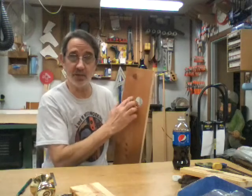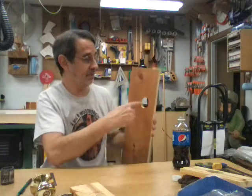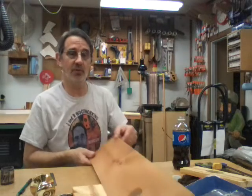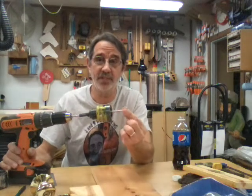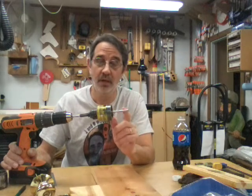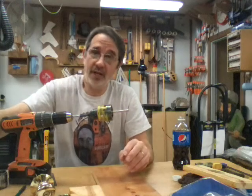The best way to cut this hole out is with a hole saw — that's how I cut them. But there's no hole and no guide for your drill bit. So what I do — I've been doing this for a long time in house remodeling — I have a hole saw the size I need, two and an eighth, with a quarter inch diameter steel rod. Get them at the hardware store. You take the drill out and you use the rod. If you use a drill, it can walk sideways.